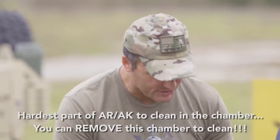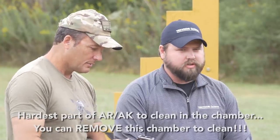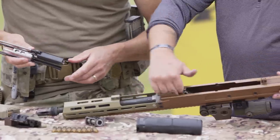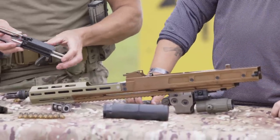There are no crazy moving things — it's different, but it's the same number of parts. It's simpler than you'd expect looking at it from the outside. That's a big deal because soldiers have to be able to clean their weapon. I can literally reach everything in here. Our engineering team understands that Rube Goldberg devices don't do well in combat — we need few parts, easy cleaning, and easy lubrication points. This is a field strip at this point. The barrel and barrel extension are fully accessible. There's no more star chamber, no more dental picks — just a rag.